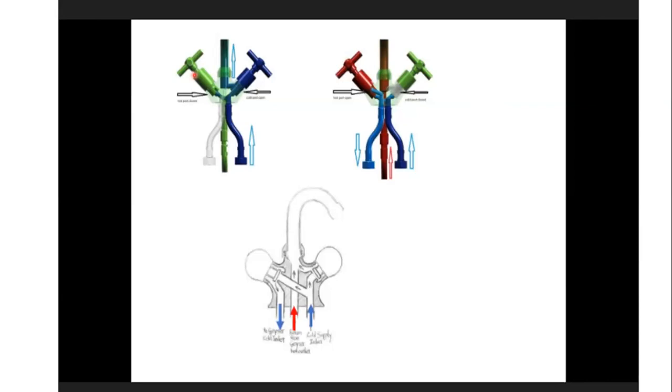They must not try and tighten. In this case, this would be, for example, a quick hot tap because they have this configuration. Do not try and tighten it. It's not faulty. That is what it's designed to do. That is the expansion taking place. That is where the expansion takes place. That's why it drips. When the geyser has heated up and the water is warm again, it will stop. So it's not faulty. Explain that to them.